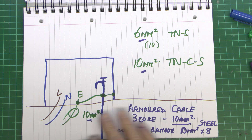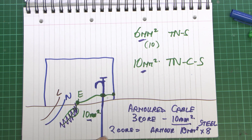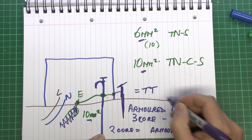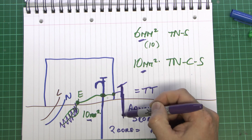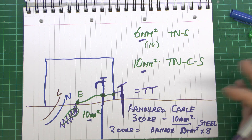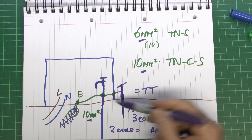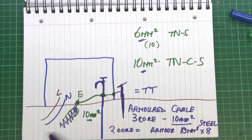If you found it far too expensive to use this approach, another option would be to ignore the earth connection coming in from the main building and just install your own earth rod in the ground, turning it into a TT system. That's always an option, but it's a fairly poor one in most cases, because you're going to have to put the rod in the ground — extra expense and cost — and in some types of locations you may need several electrodes or some kind of grid in the ground depending on local conditions. You're also going to have to have RCDs to ensure it trips in the event of a fault to ground. So a lot of extra cost and bother, and although using somewhat larger cables may cost more, in the end it's probably the easiest option, and the earth from the main building is going to be far more reliable than some piece of metal jabbed into the middle of somebody's garden.